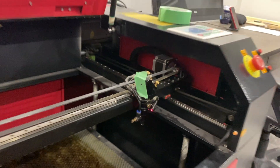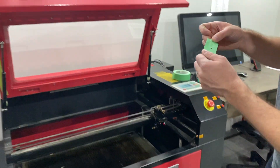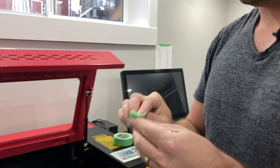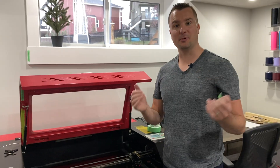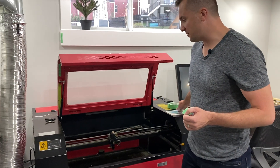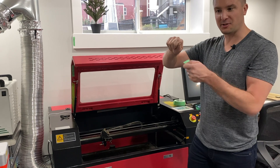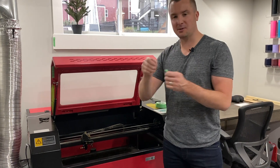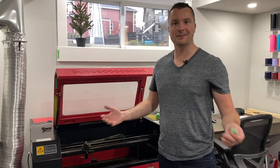So that's not the reason we're having some issues with the laser right now. If you're ever aligning your laser, that is exactly what you want to see. If those two holes were in different locations, what I would do is open up the left side here. There is a mirror over there that looks very much like this one — it has three screws at the top. I basically just turn those screws until the second laser, once the mirror is over here, hits the spot it did when it was on the left. We will show a video of that the next time it goes out of alignment.